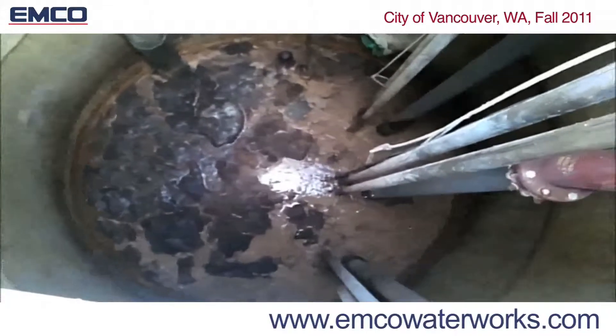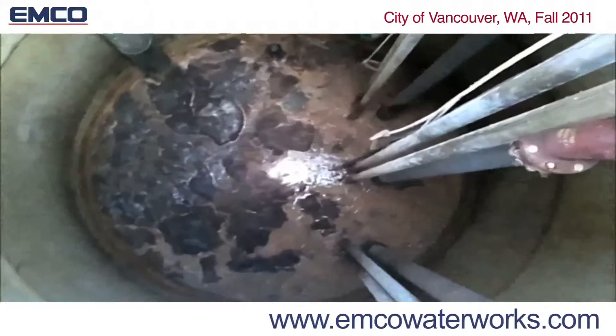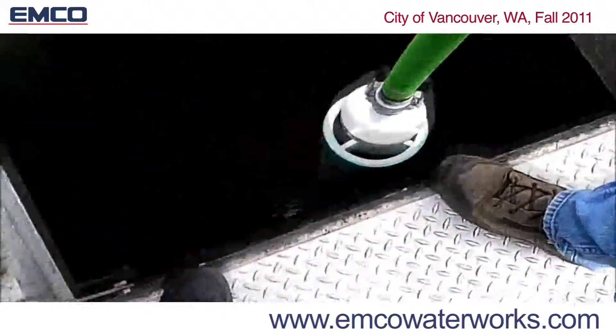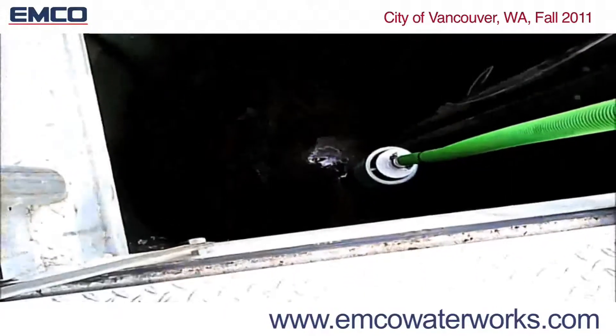The Littlejohn Digester is a very efficient fine air diffuser type aerator that works on the principles of an airlift pump. Low pressure, high volume air is delivered from a very reliable regenerative air pump installed outside the wet well or grease interceptor.